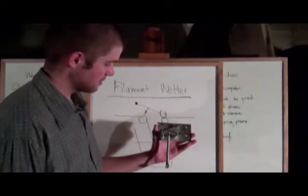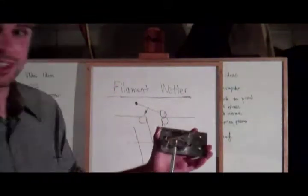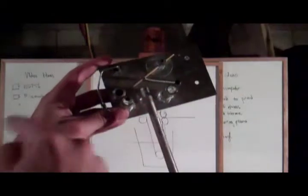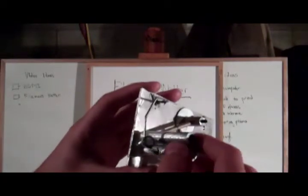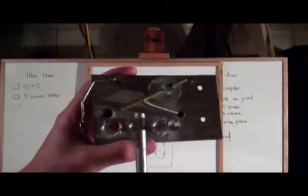This fiber can be pulled through and it wets itself as it comes out. By adjusting the spring tension, you get just the right amount squeezed out. Here is the smaller of the filament wetters that I've made. You can see the little pivot arm on it — that's the little spring. You can see the little arm on a spring, the lower pin, in, down, around, and out. It also has a little stabilizer so that when you pull the filament out sideways, it doesn't fall off the roller. The pins have little grooves in them, just to keep the filament centralized as it goes through the entire setup. This just bolts to a piece of vertical wood, ready to rumble.